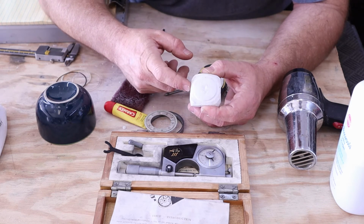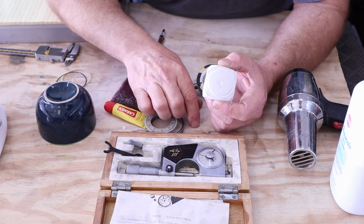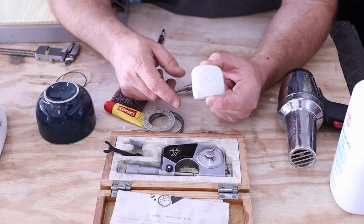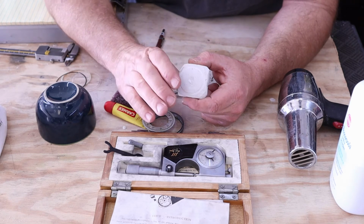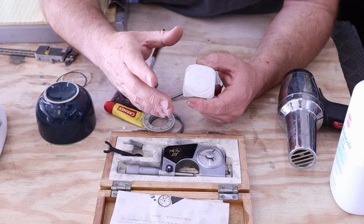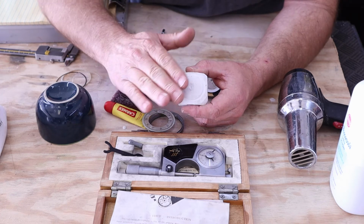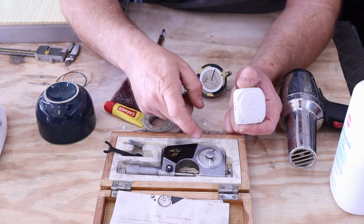But you could 3D print a particular mold where you have a gap for whatever size or thickness of plastic you're going to be using. Or this was a Lexan, any kind of ABS plastic that's thermoformable, and build a mold where the two halves come together as a source to sink the heat. I guess you could smooth it with acetone to get a really nice smooth finish, so that you're not imparting a finish into the lens itself.